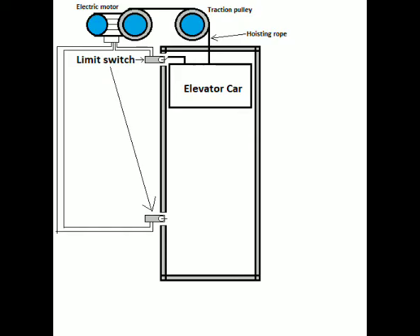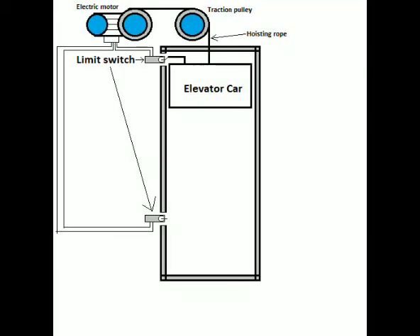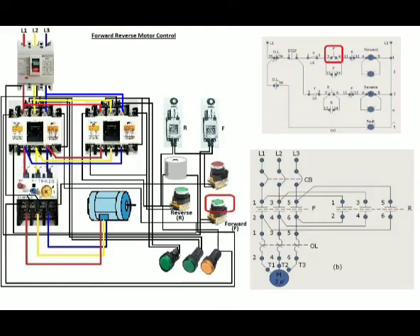The hoisted upward or downward enclosure of the elevator is called the elevator car. If you push the forward push button, the elevator car goes in the upward direction. Upon hitting the movable lever of the limit switch at the upper floor, this will stop the running electric motor. From the stop condition, the lower ground destination of the elevator car can only be done upon pressing the reverse push button. If the movable lever of the limit switch was hit by the contact rod above the elevator car, this will also stop upon reaching the destination floor.